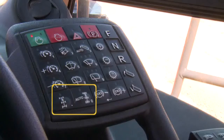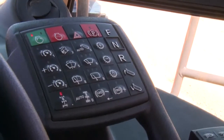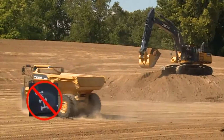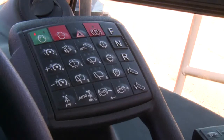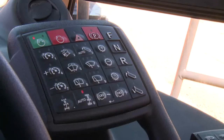The two lower left buttons on the touchpad are used to engage and disengage the differential locks. Pressing the left button engages the interaxle lock (IDL), which locks the front axle driveshaft in a 1-to-1 ratio with the rear axle's driveshaft. The interaxle lock can be engaged on the go at vehicle speeds of 12 miles per hour or less; it will also disengage if speed exceeds 12 miles per hour. Avoid using the diff locks on hard or compacted surfaces, as driveline windup causes increased tire and driveline wear. The button to the right engages automatic differential lock (ADL), which limits wheel slip and improves traction without operator input by controlling the cross axle and interaxle diff locks.